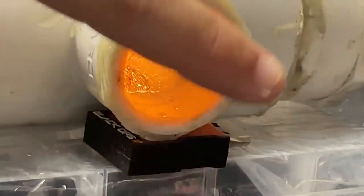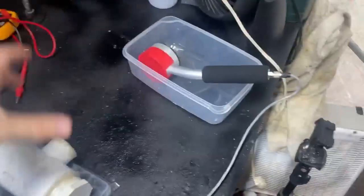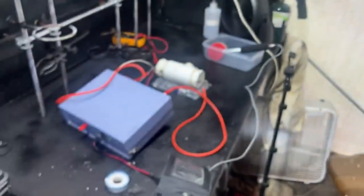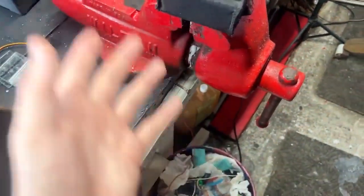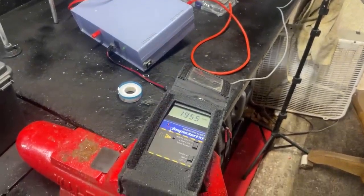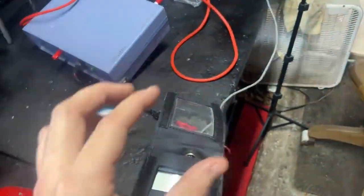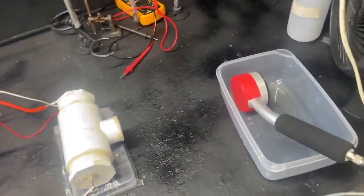Now all we got to do is hook up the high voltage and we'll have our x-rays. We got our trusty Geiger counter set up right here, x-ray tube pointing right at it. Nice cone beam goes right there, and we can read our counts per minute over here. Now it's time to flip this bad boy on. Three, two, one... I didn't have it plugged in. Okay, so I plugged it back in. Now it's time to turn it on for real. Yeah, that's the Geiger counter completely clocking out. If you notice, from the time I flipped it on to when you got x-rays, there was a little bit of a delay — that's because the filament was heating up. So you have to wait for the filament to heat up to really start getting the x-rays. Awesome — now we know it works.